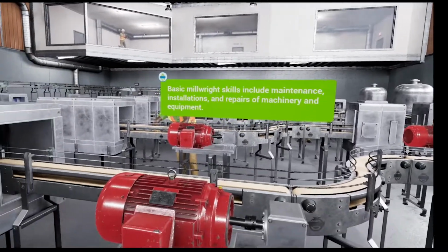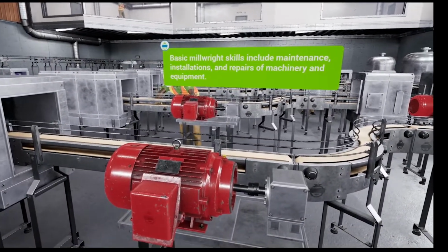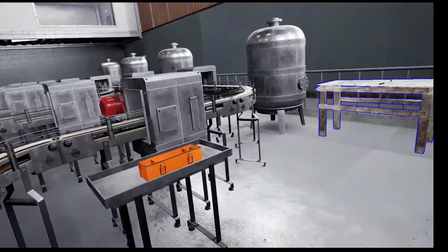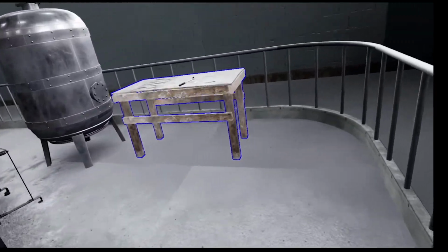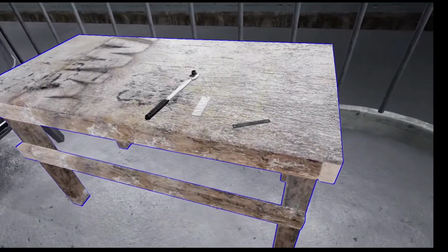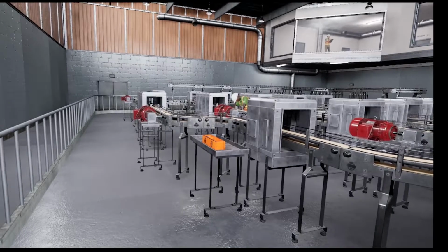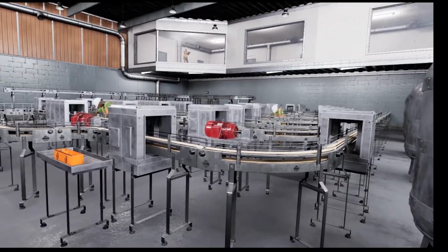We are performing a rough shaft alignment on these motors to look for soft foot. Soft foot is an industry term that is used for machine frame distortion. The distortion is caused when one foot or more on the machine differs in height from the other feet.